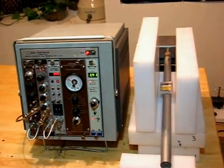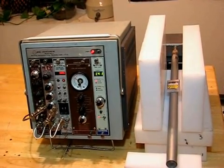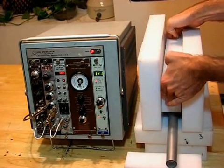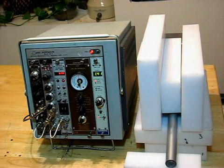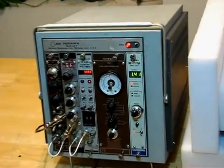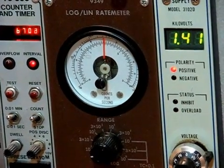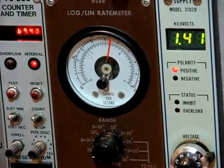Let's add one more piece of plastic. Now our detector and source are surrounded on four sides by fairly thick plastic, and the meter is indicating about half scale. In other words, that's about 50 counts per second being produced by this neutron source.